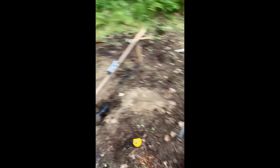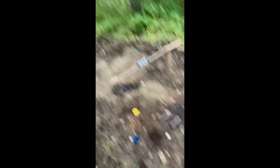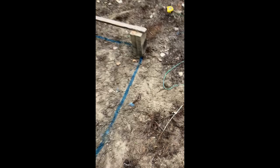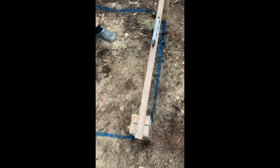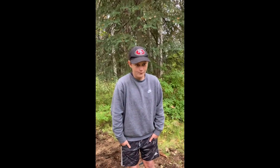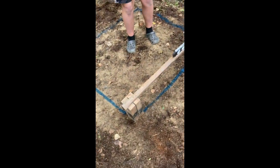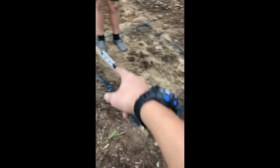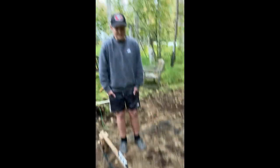That'll probably be done by end of day because it's getting close to seven o'clock and my cousins are here screaming. Trying to get this done, so that's day one. After about half an hour of digging and making everything perfect, it's not raining which is great because I just finished. As you can see, that is like perfect - perfectly in the middle, completely square. This type of foundation is very labor intensive obviously, but it's super sturdy. Since the posts are a foot or two feet in the ground, it's not going anywhere - the ground down there gets pretty hard.